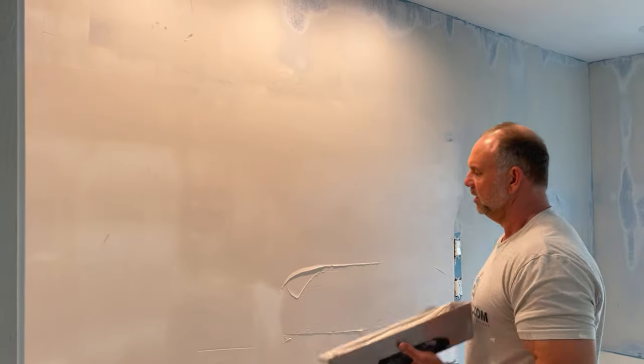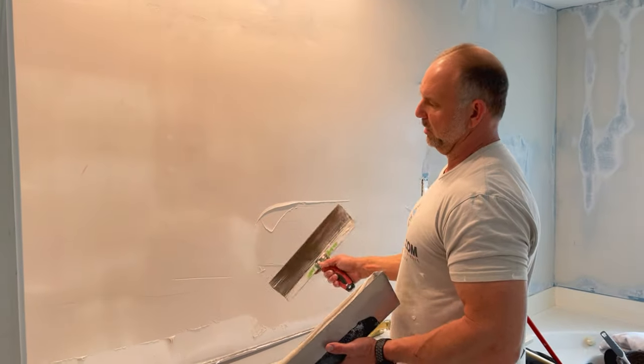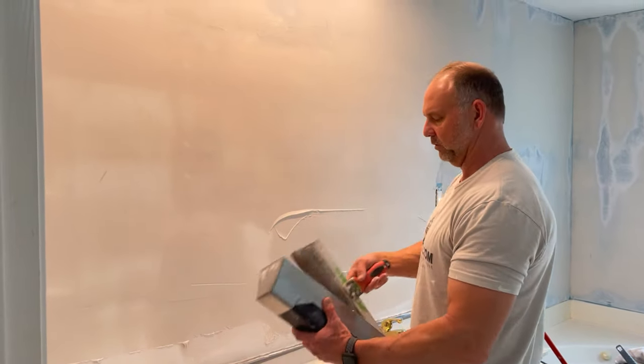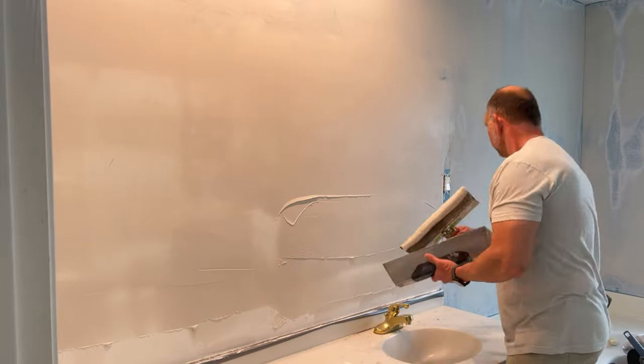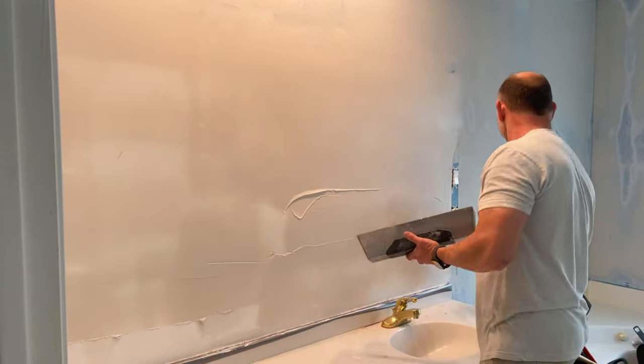Basically, we just want a whole coat over every bit of the wall. That way, if something's going to bubble or blister or anything, we can see it before we put our final coat of vinyl mud over. Once you use vinyl, you have to let it sit, unless you want to take it all back off and redo it because it's not dry, or because it had a bubble in it.